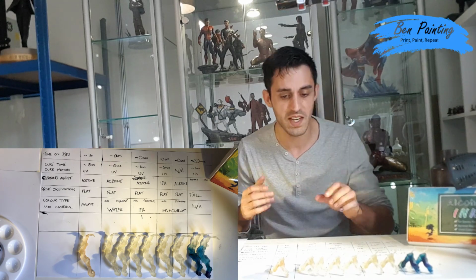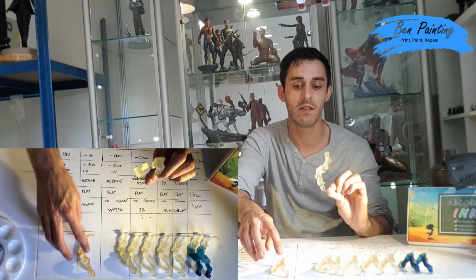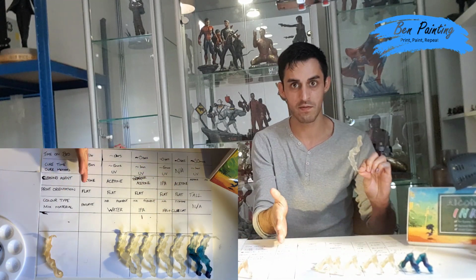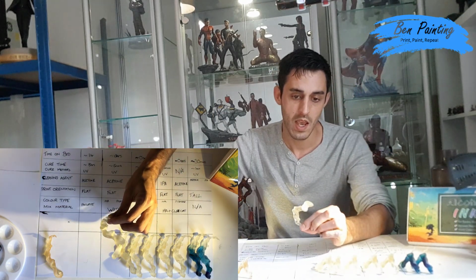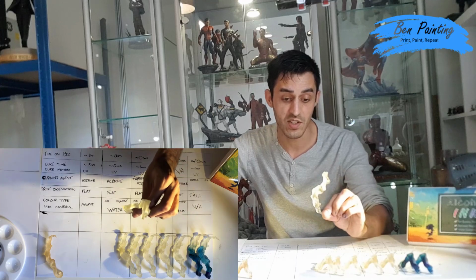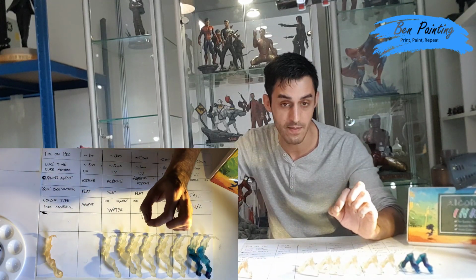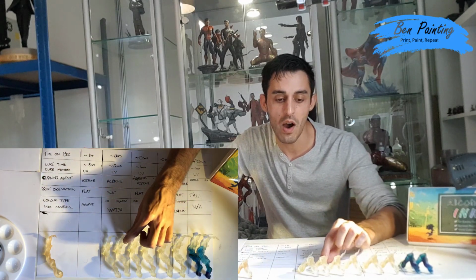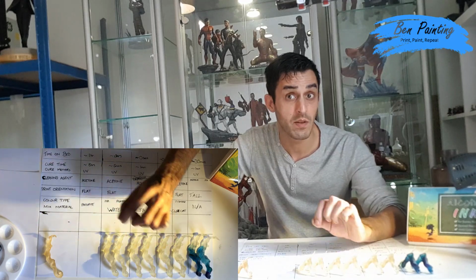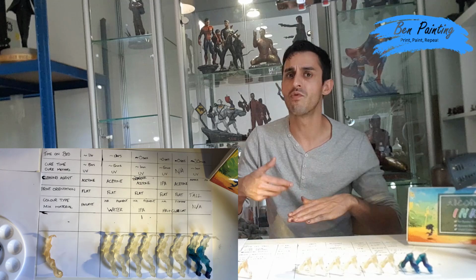But the point is, I would say here that my first print with the acetone, without overcuring, and I printed this way, this is my first print, down to the last print. One, I would say that the acetone is definitely the best way to clean it, alongside zero to very little UV light. But two, I was also filling up my vat, printing, and then once it printed, I'd refill the vat. So I wasn't completely cleaning it out each time.